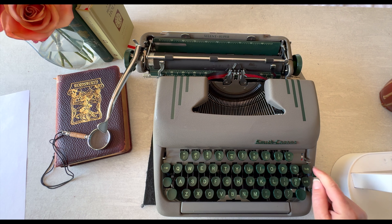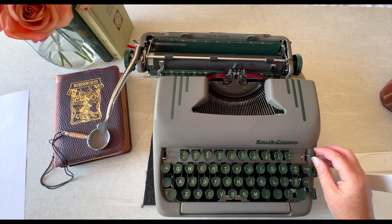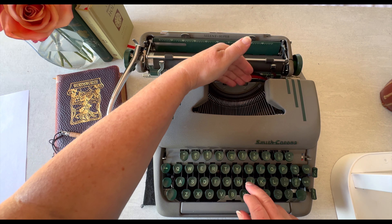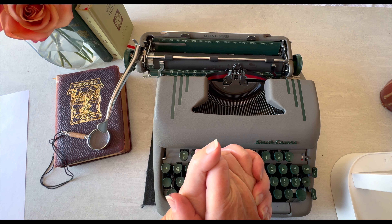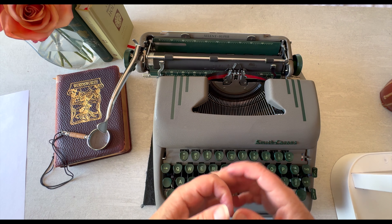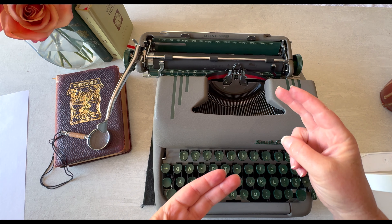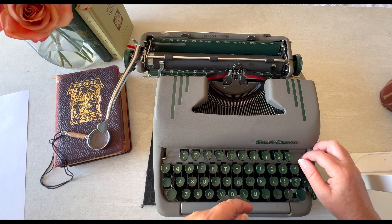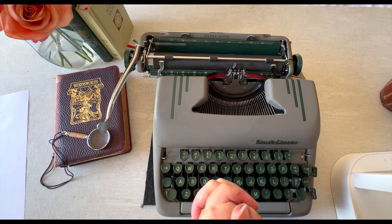This is your color selector. Right now it's on red. All the way up to the top there's a blue dot for your black ribbon. The white setting is a stencil setting — the ribbon vibrator won't move, so the type bar just strikes the paper without a ribbon, leaving no ink. That's a stencil setting you'll probably never use. If you're typing and your typewriter feels stiff, stops, or the impression is very light, two things to check: try reversing your ribbon, and make sure your color selector hasn't been bumped off the black or red setting. That solves many issues.